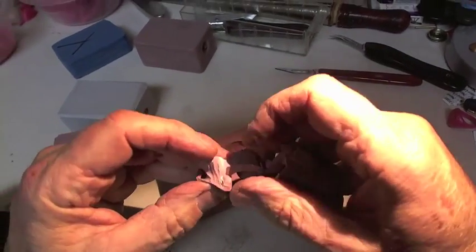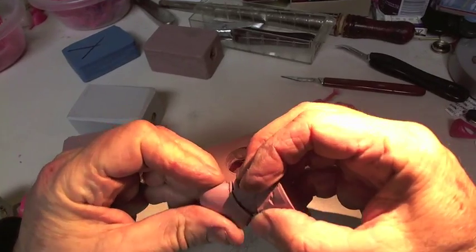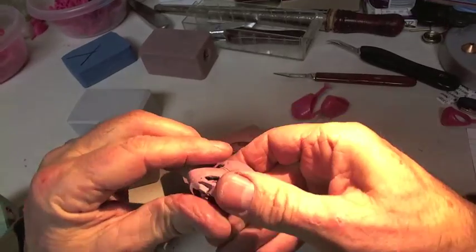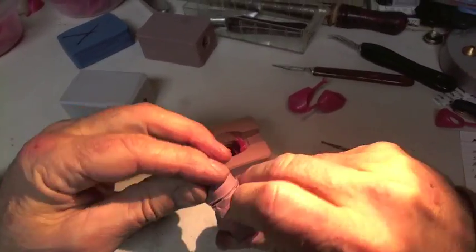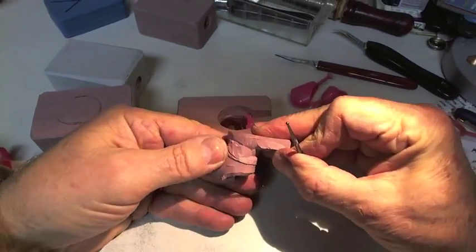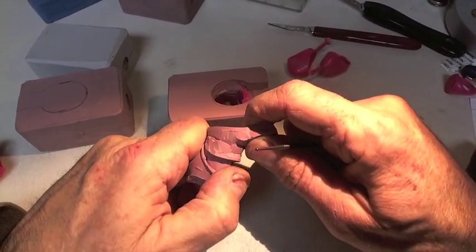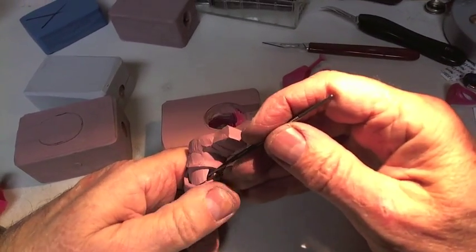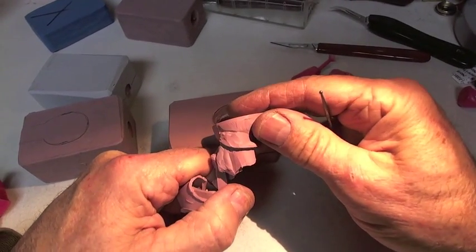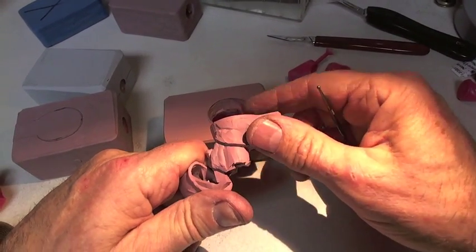This is not going to be a production mold. The reason it's causing so many problems is because I didn't cut it in such a way that the plug unravels in an organized fashion. The best way for it to happen on a mold like this is when I'm pulling this out of the mold, the spaghetti should peel the bottom of the plug out of the cavity — this part and this part comes first — and then the piece of spaghetti begins to unfold.